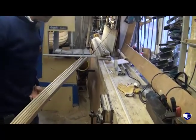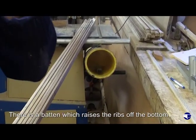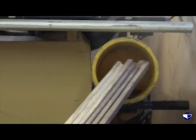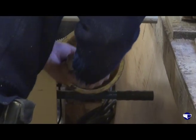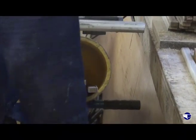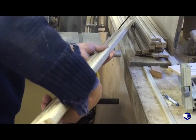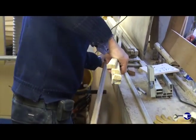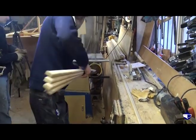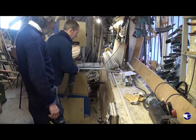In the steam pipe I've got a little batten raised up from the bottom just to keep the ribs up off the bottom of the pipe so that they're in the steam all the way. The important thing is not to have too much of an angle on your pipe so that they don't all slide down and you have to stick your arm in up to your elbow to drag them out — that's not very sensible. It does help if you've got a cold, just to stick your head over the pipe for half an hour. Stick those in there, leave the ends gettable, cover with a rag, keep some of the steam in.